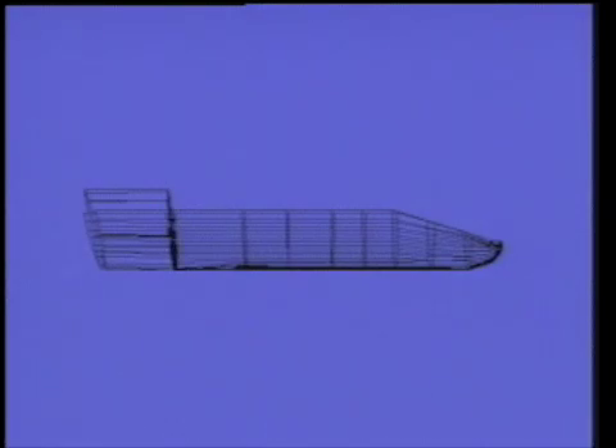The layup we are about to document is the lower shell of the Super Mileage Racer. This was more complex than the upper unit and will serve as a better instructional tool because this shell will be made in two cures. We will first laminate the outer skin and vacuum bag it until it is fully cured. After it is cured and the vacuum bagging materials are removed, the honeycomb and inner plies will be bonded in place. We do not recommend laminating a full sheet of honeycomb into the outer skin when using wet layup techniques because the cells will fill with resin. It is best to allow the outer skin to cure, then bond the honeycomb and inner skin to it later with epoxy.